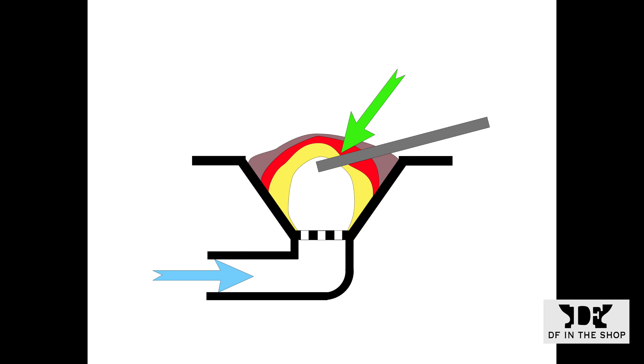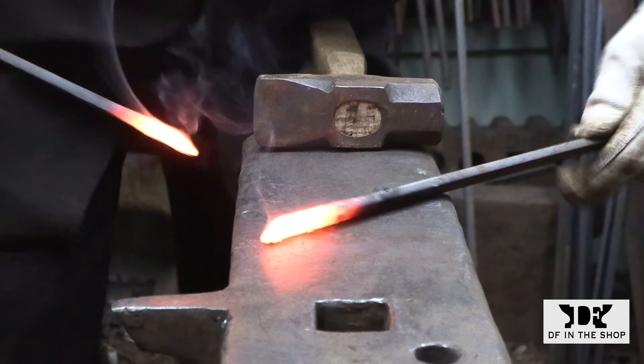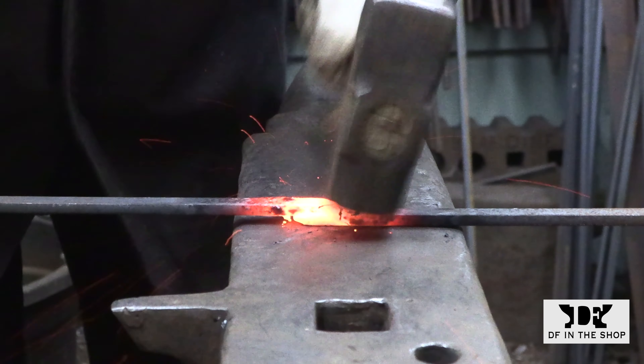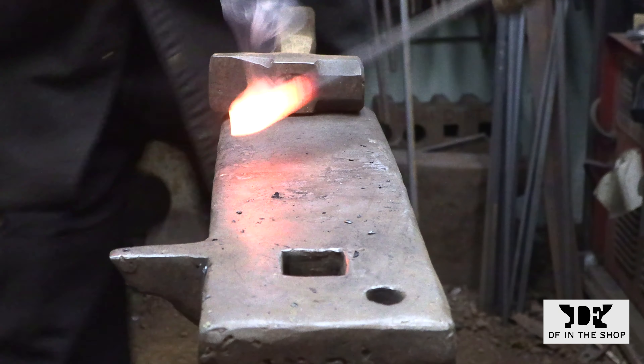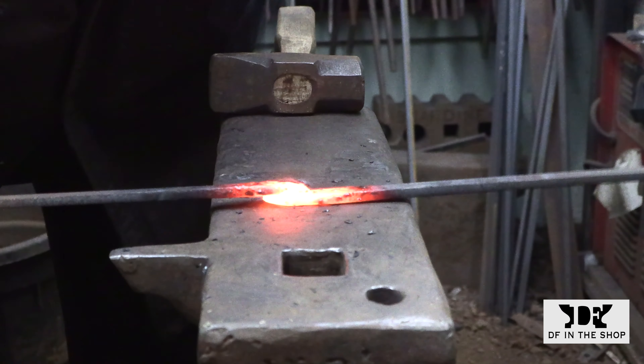In this example I've let the height of the fire drop down even more, so you can see there is virtually no neutral zone and you have no choice but to be working in the oxidation zone. You can still forge in a fire like this but there is absolutely no way you're going to be able to get more than one out of ten welds to stick in an oxidation fire like this. When I pull the bars out of the fire everything looks good, but when I stick the two pieces together I'm feeling absolutely no grab. There has been an oxidized coating that has gone right through the flux layer and has created a barrier that is going to prevent these bars from welding. There isn't anything you can do. On the second attempt with the same bars — again everything looks good but I'm not feeling anything grabbing and they are just not sticking.